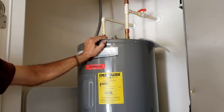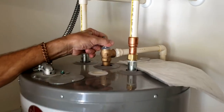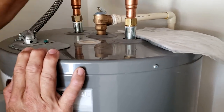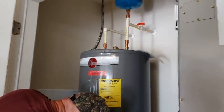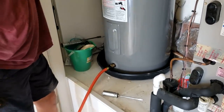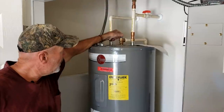The water is running inside, and you can hear it gurgling as the pressure is being taken off this tank. What I like to do is very carefully open this safety valve. We're going to wait a little while because there's still pressure in there — that water is hot in the tank, it's gone up and over that overflow valve. In the meantime, I've connected a hose to the lower drain point. We can go ahead and open the valve down here — it just takes a screwdriver and it's a quarter turn. Now it's just like a glass of water turned upside down — it won't drain out, so we have to introduce air into the system. I hit the toggle and the air starts coming in, which enables it to drain out.